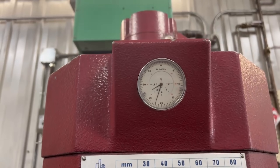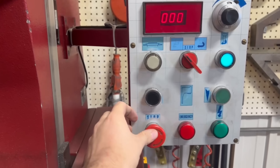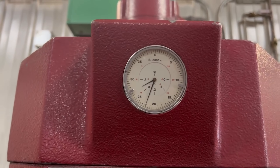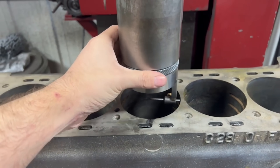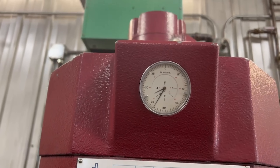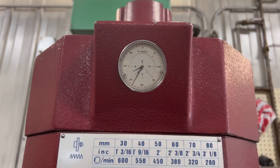The top of the parent bores of this block are unfortunately fairly out of round, making it much more difficult to center up. However we can move the indicator to the leftmost side of the bore and then to the rightmost side and move the table of the machine until the indicator reads the same value. The same can be repeated for the y-axis by comparing the front to the back, and at this point we lock the table down and we are centered.